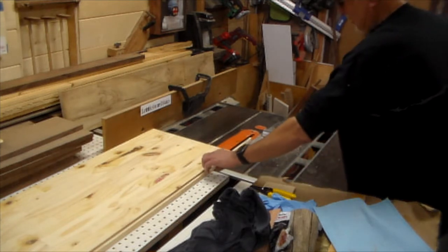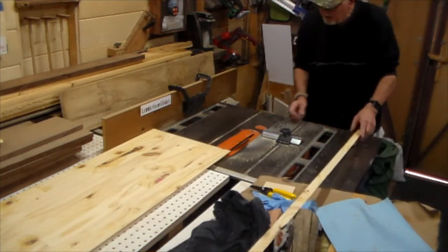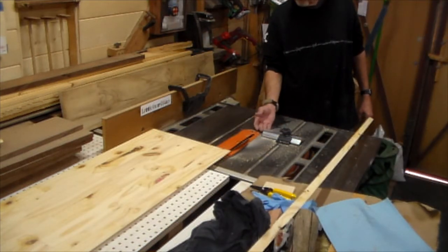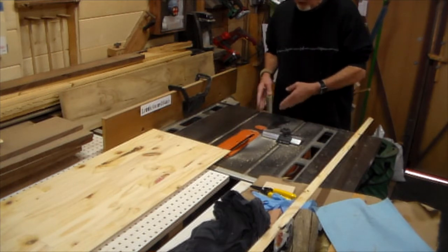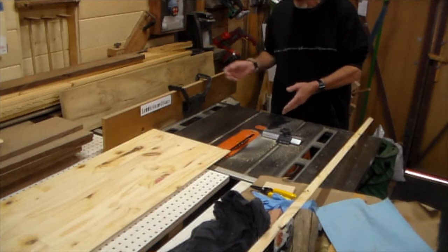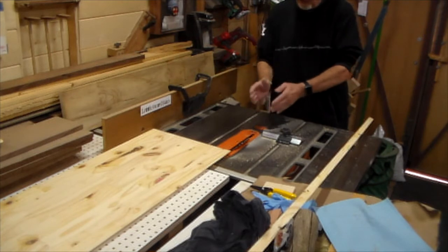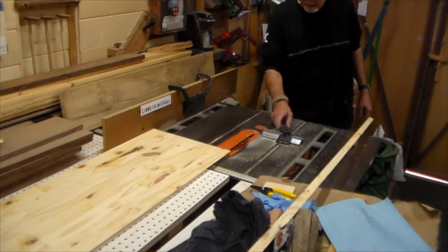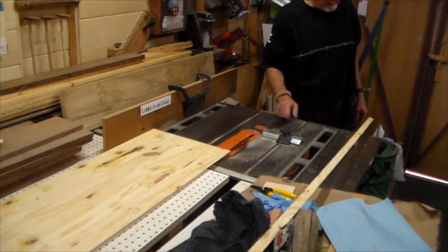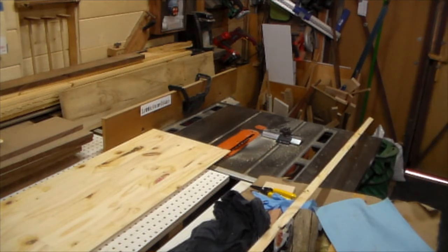Did it. I'll tell you, this thing, nice. I just got that thing. It's got a little ball bearing here for the edge of the wood to run against. It's really a gizmo to adjust so you can run consistent thin strips. Set it, move your fence to the next cut, and all your strips will be the same size. Pretty nice. It's from Peachtree, and it's a quality aluminum. I have to admit, it was only like $23. Cheaper than some of the others that were pieces of crap.